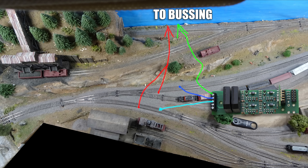So once that bit of wiring is done, it'll start sensing trains, and that's pretty cool. There's an eight-pin connector on the side of the BD4. All four pins on the right-hand side are common — they're all wired together, best I can tell. But the ones on the left are the outputs for each of the four inputs, two of which we have wired up at this juncture. What you do is take that right one and route it up to the common on the DS64 — we're going to show you that in just a second.